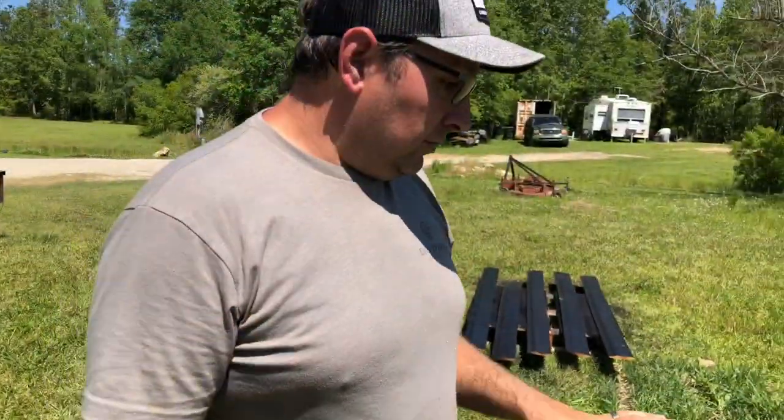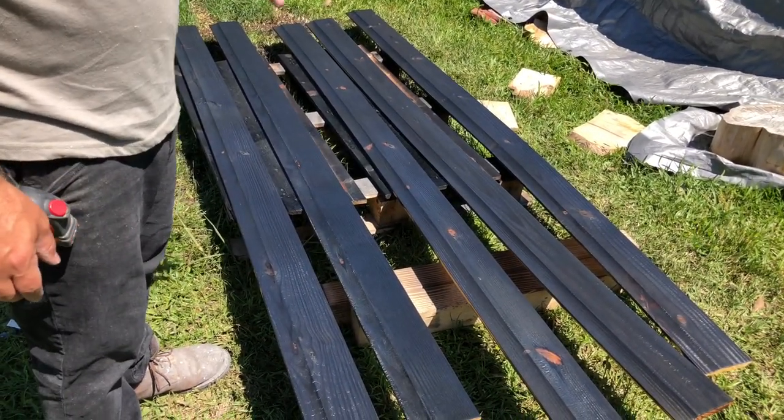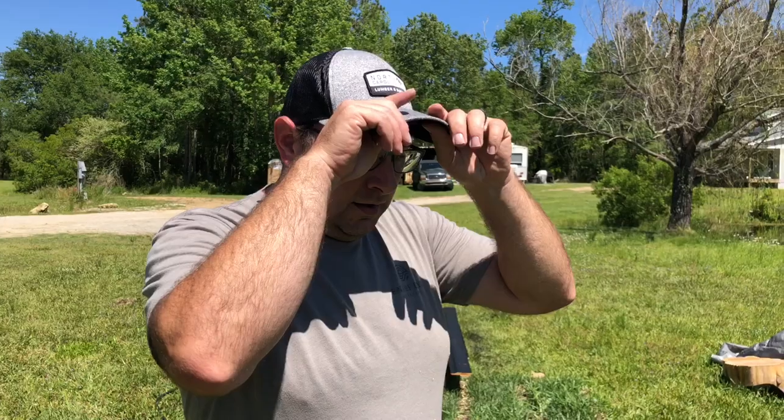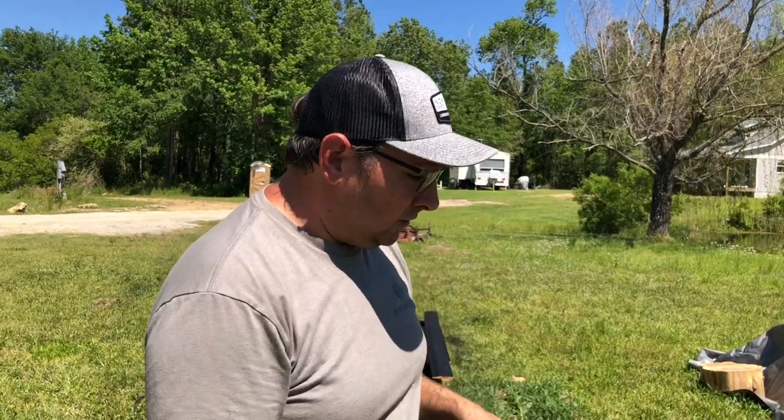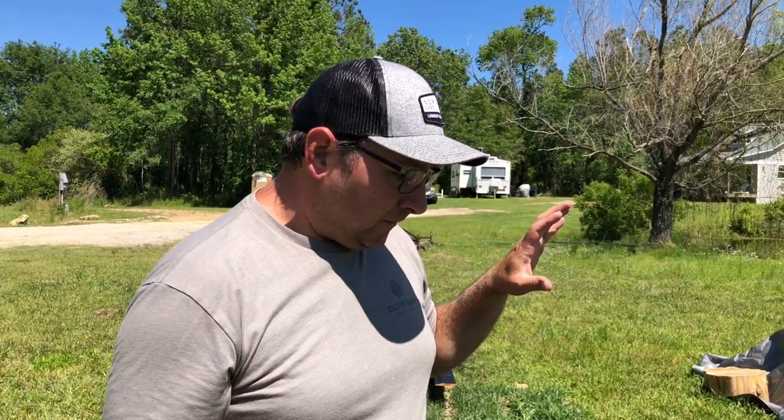The boards have been sitting out cooling in the sun, all the water has evaporated off, and now we can go ahead and clear coat them. The Shou Sugi Ban technique has been used for hundreds of years in Japan — it was mainly invented as house siding and fencing because it helps protect wood from further fire damage, insects, and water. Normally for an outdoor setting you would rub in boiled linseed oil or tung oil. For interior use, where hands are going to touch it and I've got kids, I'm going to use a water-based polyurethane.